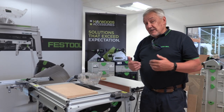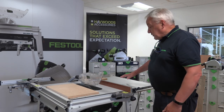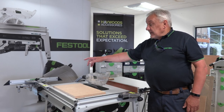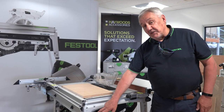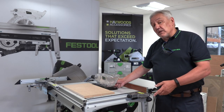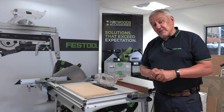The set version includes, as with everything from Festool, better value when you buy it as a set — you get everything for this machine. For example, it comes with a side table, which means you can rip up to 600mm, or 610mm at a squeeze. You've got a sliding table that mounts in two positions. At the moment it's mounted to the rear of the machine so we can show you the controls. But this portion can mount in the front, allowing a crosscut of 800mm at 20mm depth of cut — so for cutting a sheet of MDF, you've got 800mm crosscut capacity.